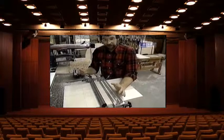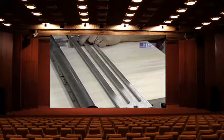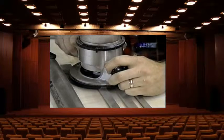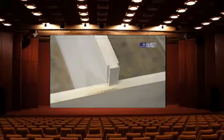Now with the side piece clamped in place, the instructions for my jig tell me to use the same router setup, but this slot, to make the female part of the dovetail. Now let's check the fit. That's good. In fact, it's so good, I'm not going to drive it all the way, or else I'll never get it apart. Now I can do the other side.